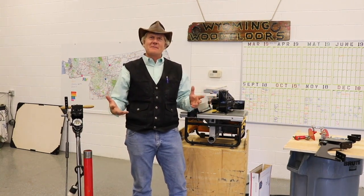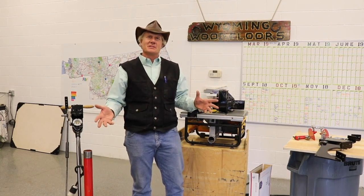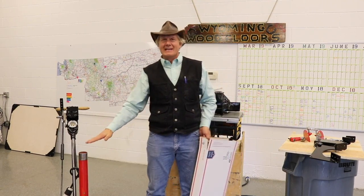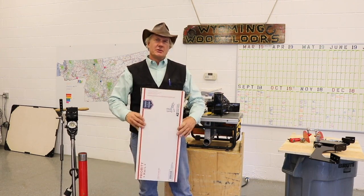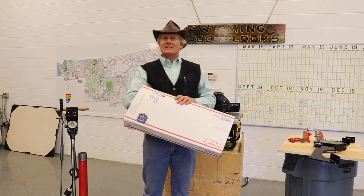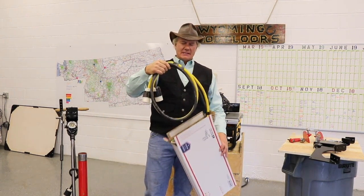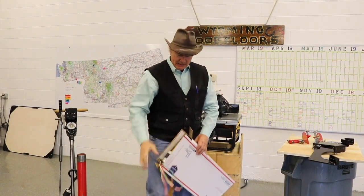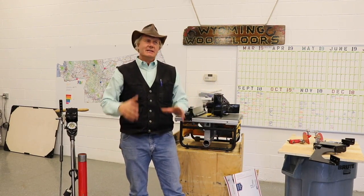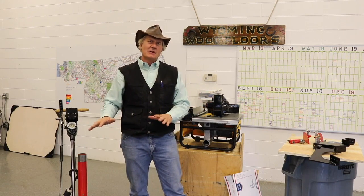Finally, let's talk power. Power has always been a challenge — you need three-phase power, and you really shouldn't be going into a three-phase power box in a school or municipal facility and hooking it up yourself. Typically when we send out an estimate, we ask the facility owners to provide us power, but if they're not ready, we end up waiting for an electrician — sometimes half a day or more. We've discovered the flat rate box from the U.S. Postal Service. This past year we had great success putting a pair of pigtails in a flat rate box, telling facility owners we need three-phase 30-amp power on each pigtail. We get there, the power is hooked up, and we're sanding.